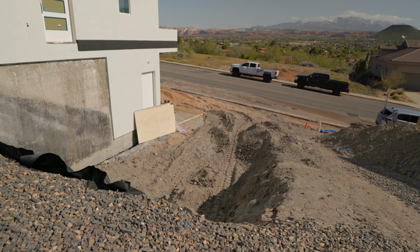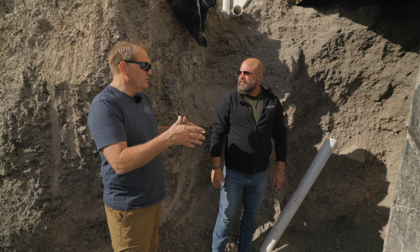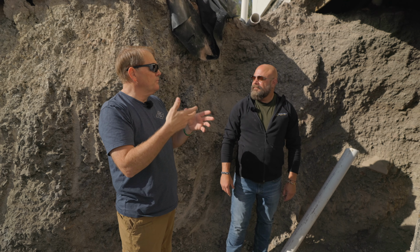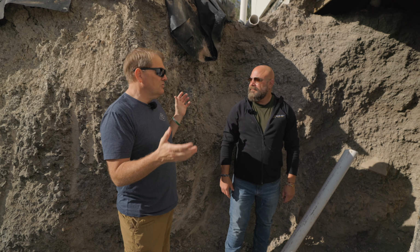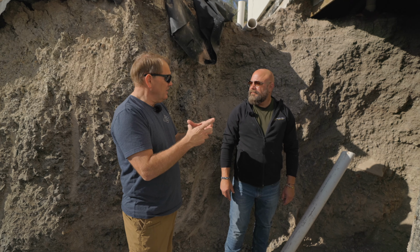But basically one of the problems is a worker or a subcontractor, someone's making a decision, so let's just do this. But there's so many variables. When it comes to water, people make huge assumptions. I'll just put the pier down and it'll just be okay. When they were actually drilling for the pier, that's when they saw the water.